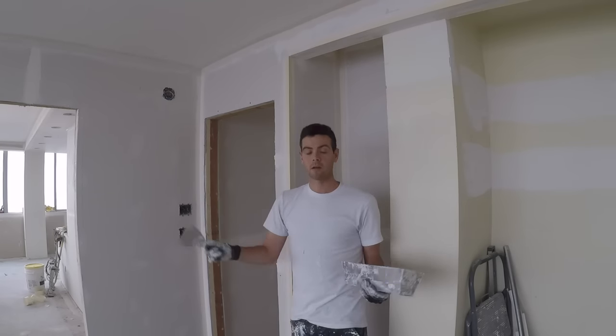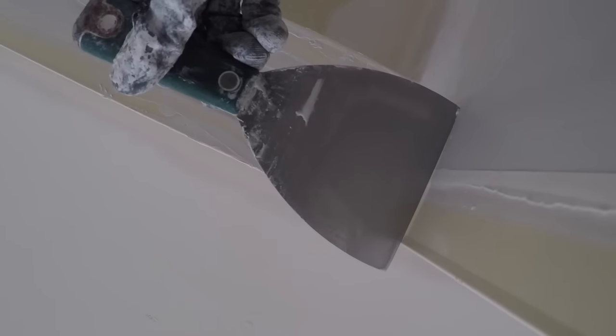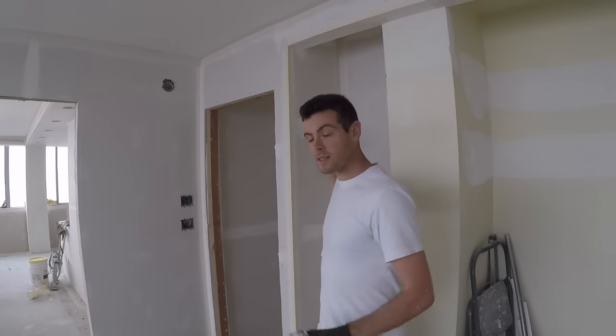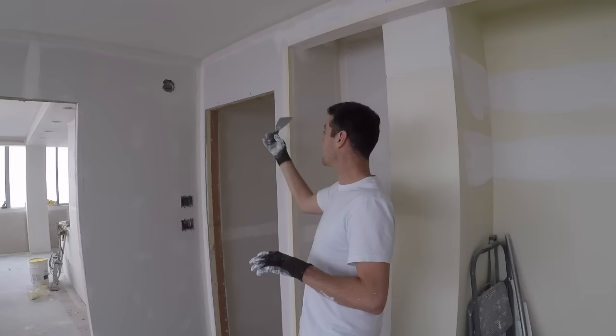Now that I've gotten most of the mud out I'm going to check the corner bead for adjustment before I firmly embed it in place. Rule number one: does it line up with my existing corner bead? Yes — it lines up perfectly. Next, can you see light through the bead? Right there — room to fill. Check the other side — yes, room to fill. I do the same check in the middle and on the bottom of the corner bead. If one side has too much fill I push it a little bit with my knife and then double-check to make sure both sides have room for fill.